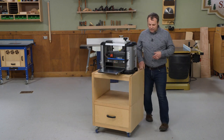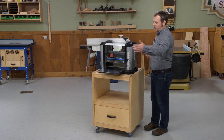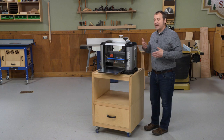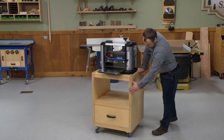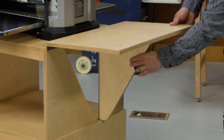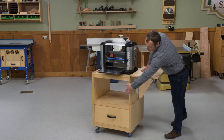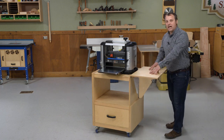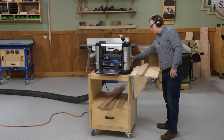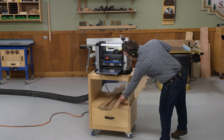For some planer-specific functions, let's look a little closer. When you're working with a planer, one of the things you'll end up doing is transferring stacks of wood as you process it — you'll have a stack that has to go through the planer and another stack that's already been through. To handle that, you can flip up this wing on the side and it's supported, so now you have two staging areas: the large open area underneath the planer and one to the side. This way you're less likely to get the boards mixed up as you're going along.